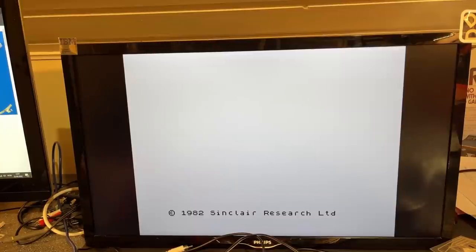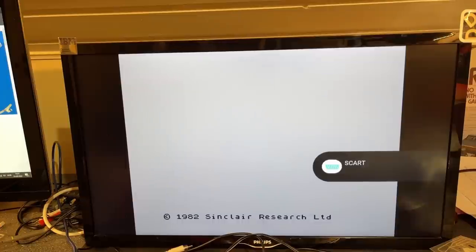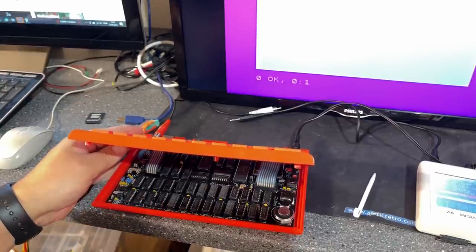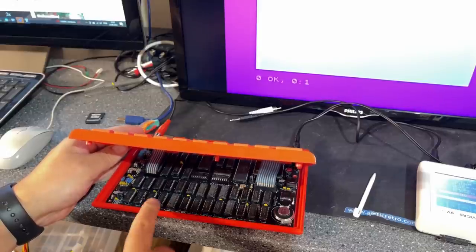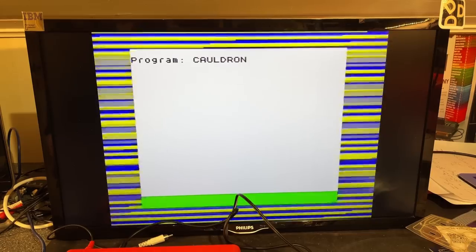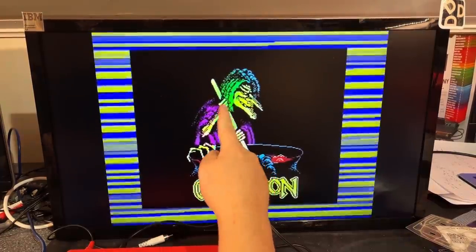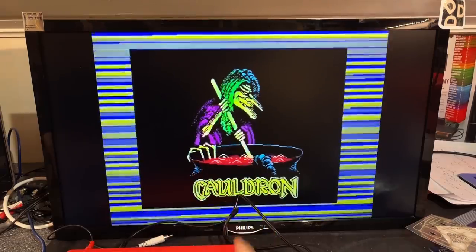Yes, I think the instruction is actually wrong. If I move jumper nine and then set border three — we have color! Good thing it was only that. So I moved this jumper from the bottom two pins to the top two pins. The documentation says it should be all the same on all three jumpers, however that's not correct. Now let's try. That's better. Picture quality is quite good. There's a little bit of shaking maybe in the picture. Of course filming a screen is not optimal so it looks better than what you see on this video.